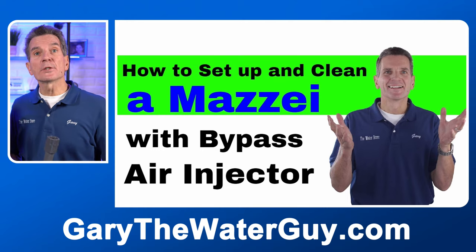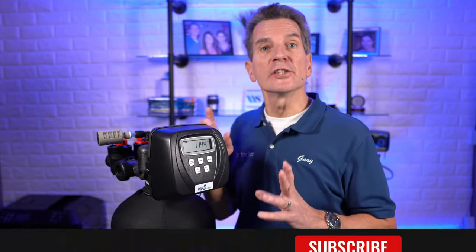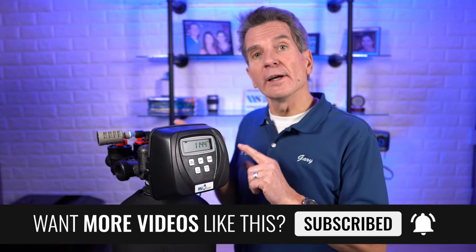But I do have a great procedure that will show you how to maintain those systems, and I'll put a link in the description down below. So a common area of maintenance for these air over media chemical-free iron and sulfur filters is the injector. The injector sometimes gets clogged after a number of years of use. So before we go any further, you need to check that to make sure it is working. To do that, you just press and hold down the regen button for about five seconds, and you'll hear the motor start up. So now the valve is moving and positioning itself and it's going into the backwash cycle.